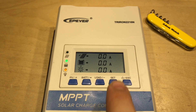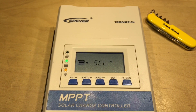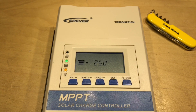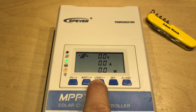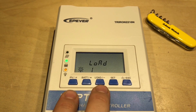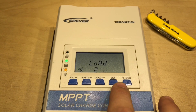To change parameters on the DS2 screen, tap Set, then press and hold the battery button to select the battery type — options include sealed, gel, flooded, and user. Interestingly, there's no mention of lithium at this point, so I'll leave it on sealed. It also asks how large your battery bank is, and whether you'd prefer temperature in Celsius or Fahrenheit. Pressing and holding the load button brings up the automatic load on and off settings — I'll leave mine at manual, setting 17, without automatic load switching at dawn.